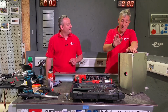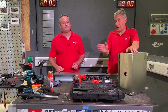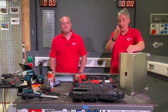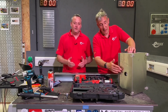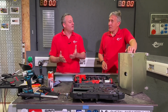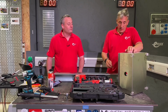You know, stainless steel, this is 316 grade stainless steel, marine grade stainless, that is notoriously difficult to work with. And okay, the most difficult bit is drilling the pilot hole. That's the issue people have got to get over. But obviously it depends on the market you're working in. If you're in stainless steel, doing a lot of stuff in food factories and stuff like that, if you're drilling a 20 mil hole to punch out a 100 mil hole in stainless steel, I would argue the payoff of drilling that 20 mil hole, and it doesn't matter, as we said, they're a bit raggedy, is that you could actually punch out a perfect 100 mil hole, no deburring, etc., with it.